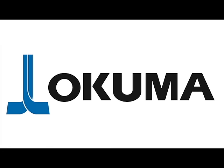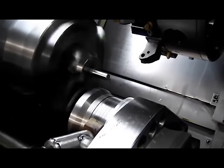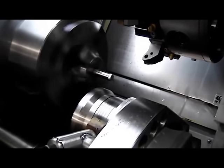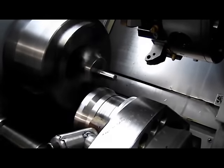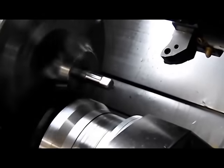The following video demonstration highlights Okuma's flat turning feature. The flat turning function synchronizes rotation of the rotary tool spindle, or M tool spindle, with that of the main spindle. This specification is used for machining polygons.